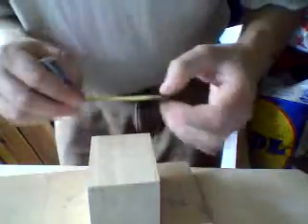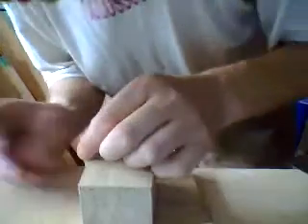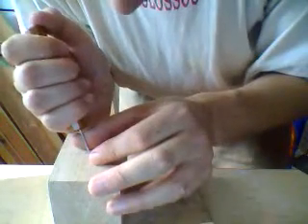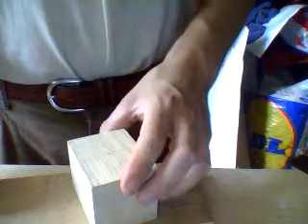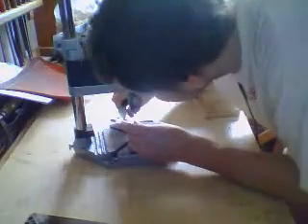Just a final check-up — this really is 28. It is. And then we have to pre-drill, so we need to find a tiny drill bit. In this case I will use the 3mm one. I will also mark and pre-drill at the other end as well. Then we have to drill — this is already a 3mm drill bit.